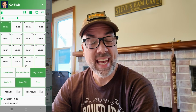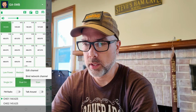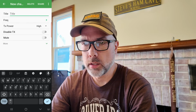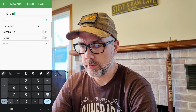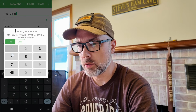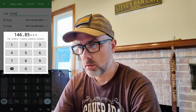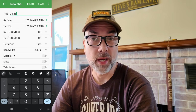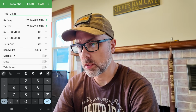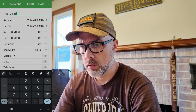Okay, let's add another repeater from the screen here. I'm going to long press that. There we go. Edit. I call this, I actually don't know the name of it, 2585. And the frequency is 146.85. And then when you key up, it goes -600. More TX frequency is 146.25. And I might have this backwards. I do that with repeaters a lot for some reason. There are no tones on this repeater. I like that. And then let's go back and save the changes.